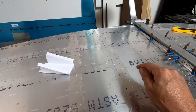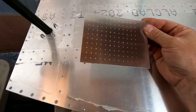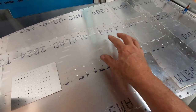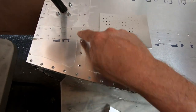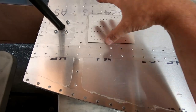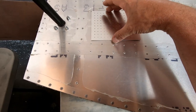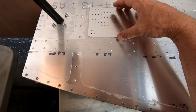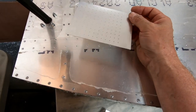Working on the removable cover comes after finishing the vent holes. The CNC-cut template for the 120 exhaust vent holes is ready. It needs to be positioned so its front edge aligns with the back edge of frame 1B, centered between the pedal rail rivets on either side. The template will be taped in place and holes hand-drilled to 1/16-inch, then stepped up to the final 1/4-inch diameter.